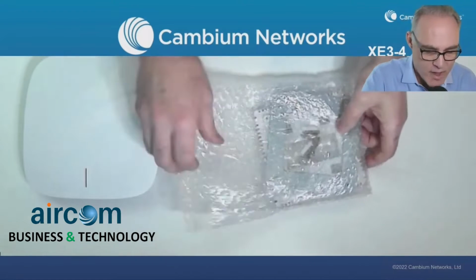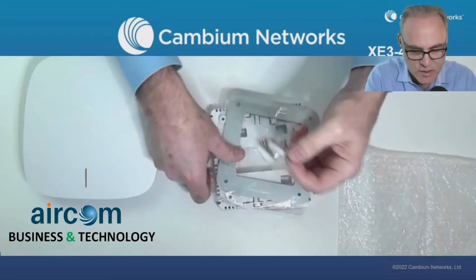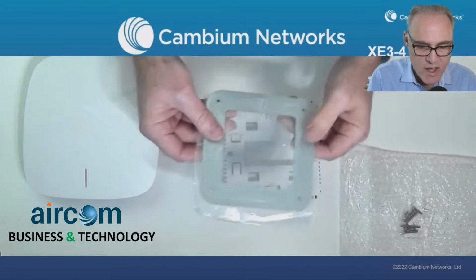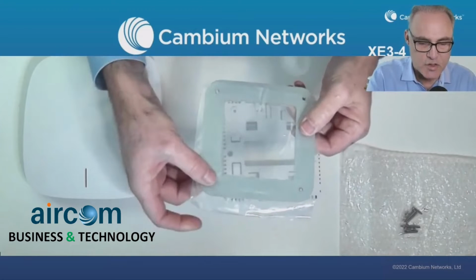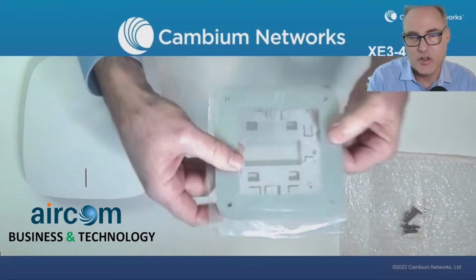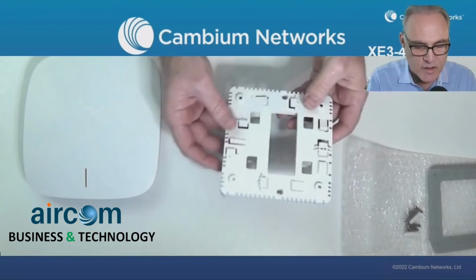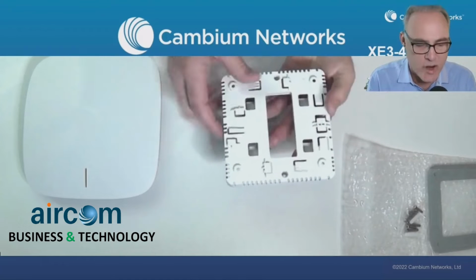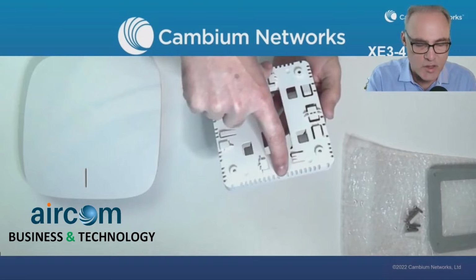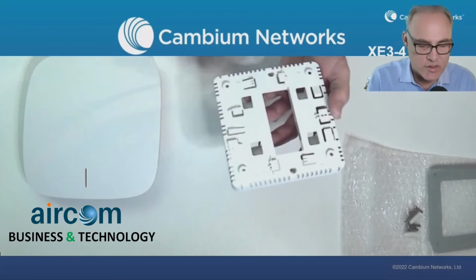All right, let's open up our bag of installation tricks. And what we find in here is a little baggie with some screws and some wall mount anchors. That's pretty standard stuff. We have a metal plate. This is useful if you want to install the AP above a ceiling tile. You put this above the tile, put the bracket below the tile. Now the bracket itself is quite unique, and I want to spend some time showing you this bracket. It's very well designed. You can install this over 2 different sizes of T-bars, ceiling T-bars. You can mount it to the wall using these 4 screws or mount it to a ceiling surface.